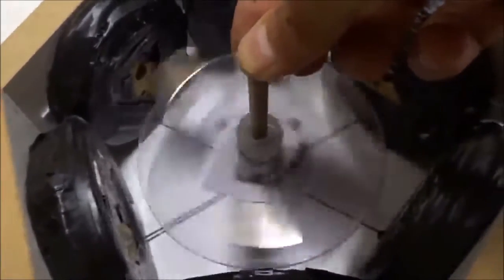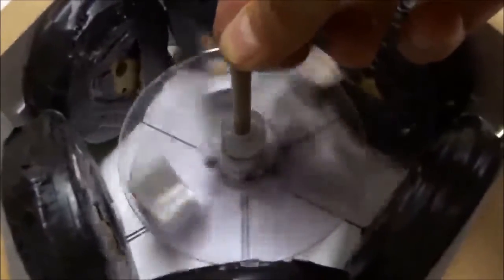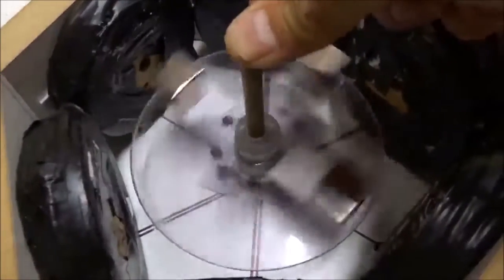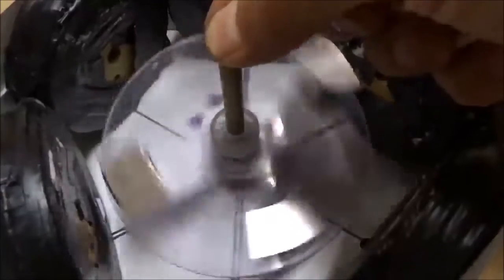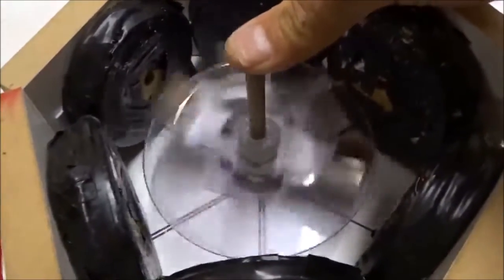You can spin this up quite nicely. Now we have our extra magnet at 240 degrees, and we continue to get anti-clockwise self-starting torque with locking, but not quite as strong as the 90-degree case. Next, we'll add our magnet at 270 degrees rather than 90, and turn it on. Again, we see clockwise torque with very tight locking. Can't really lock any tighter than that. We'll add our final magnet at 300 degrees. Again, we see anti-clockwise self-starting, with not quite as much locking as the 90-degree case.